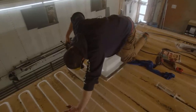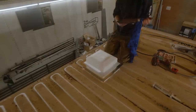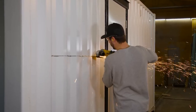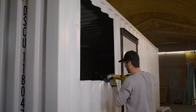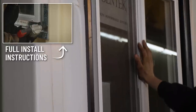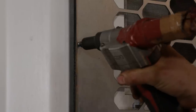The vents are getting spray foamed anyway, so the spray foam on the inside will give some additional assurance that these vents won't leak. Next, we will install the windows and door. Again, make sure the shards that land on the bottom channel are swept off to prevent premature rust. We will be installing our fixed security screens over the sidewall windows, and the end wall window will be getting a custom drop-down security screen so the customer can open it up during the day and lock it at night. These security screens match perfectly with our Container Modification World weldless window framing kits — we have full assembly and installation videos if you'd like to see more.